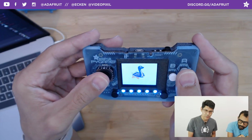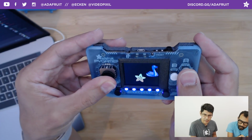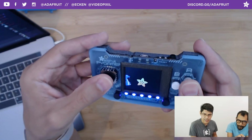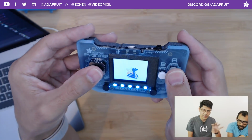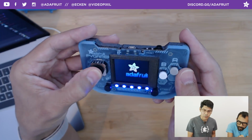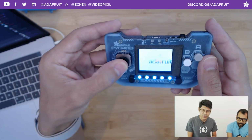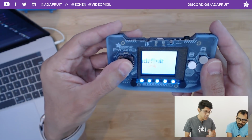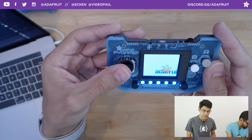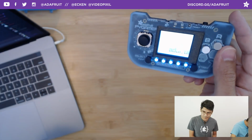The next thing I wanted to do was, it would be really cool if I had another sprite on the screen. So the second thing was to add a sprite, to separate the Adafruit logo from the Adafruit text. Hit the B button, there you go. And then I was like, well, now that I have those two sprites, it's super easy to attach controls to a sprite. So now I'm able to control the Adafruit text, going left and right, up and down, and diagonal.